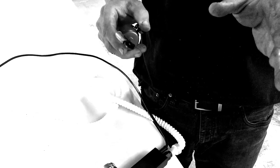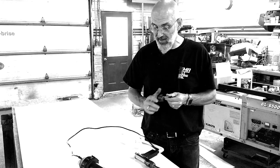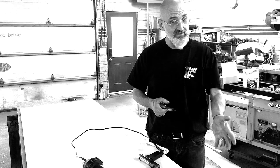As far as temperature goes, we're welding HDPE — high density polyethylene. Every plastic has its own temperature and its own rod. This one happens to be 300 degrees Celsius, or 572 degrees Fahrenheit. So let's get to welding.